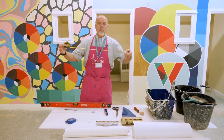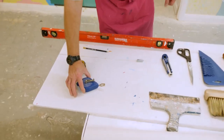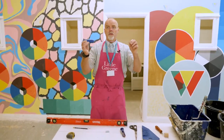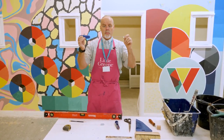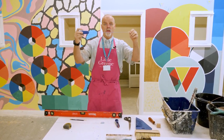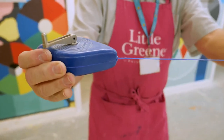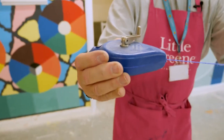Obviously the good old measuring tape — I'll explain what that's used for. And another very useful piece of equipment: the chalk line. Very useful if you need to mark your wall horizontally. This does need two people — one to hold the chalk line at each end, another to pull the line away from the wall and give it a ping. The chalk line then bounces on the wall leaving a line of chalk, which is dead straight and easy to follow.